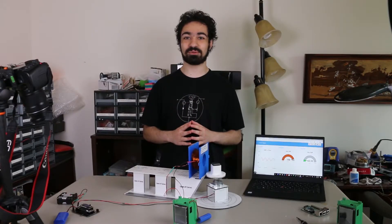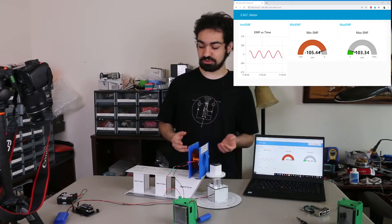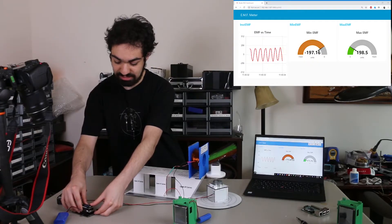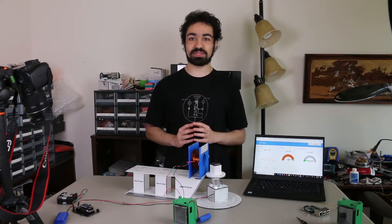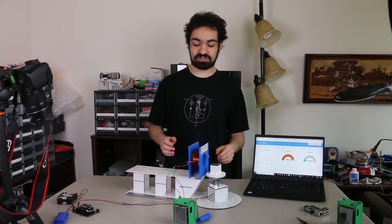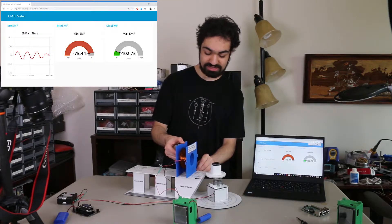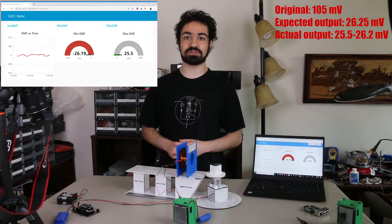With the EMF meter, we can perform a variety of different experiments with electromagnetism. For instance, we can test Lenz's law and show that by manipulating the speed — for instance increasing it by a factor of two — the peak voltages increase by a proportional factor of two. We can also demonstrate that with Biot-Savart's law and Lenz's law working together in this setup, the voltage will be proportional to 1 over R squared. So when we double the radius from 5 centimeters to 10 centimeters, we get approximately one-fourth of the original peak voltages.